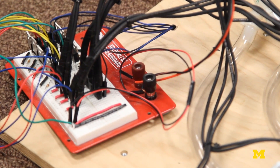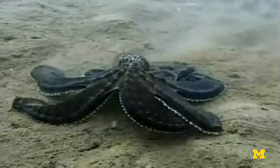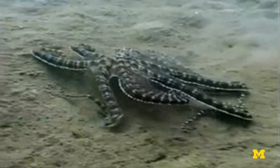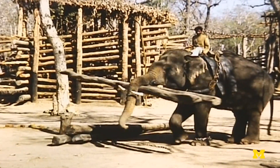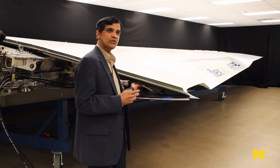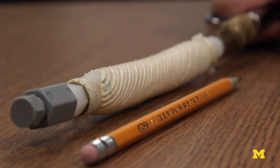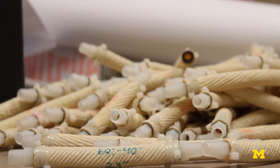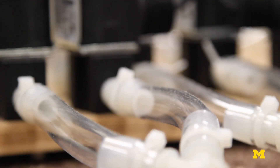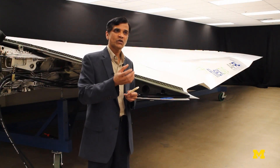It illustrates the whole idea of how to be strong and flexible. One of the new areas we started takes this idea of compliance to a different level altogether. The tentacles of an octopus arm or an elephant trunk are good examples in nature of things that are strong and flexible. We took that inspiration and started this elastofluidics research — a flexible tubing wrapped with fibers. By wrapping these fibers at different angles and pressurizing the container, we can get different kinds of motion: rotation, bending, twisting, and helical movement.